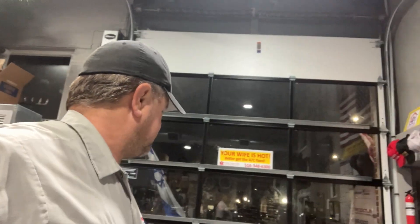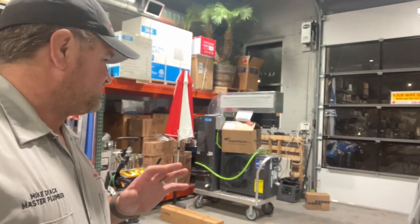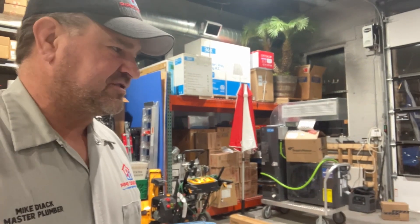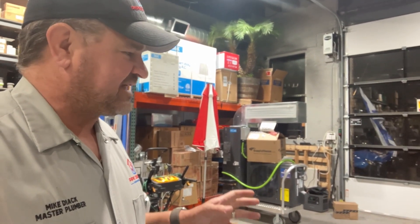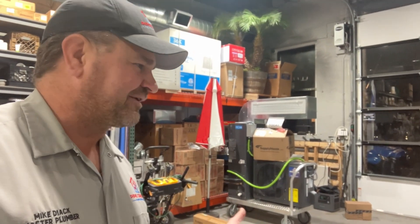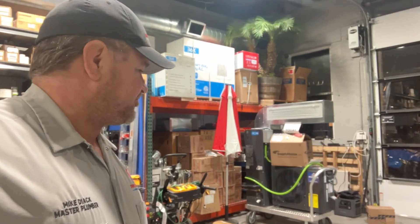It was raining outside — well, like a light mist, but now it's raining. Yesterday, Wednesday, we got a lot done. We installed the Della Optima 12,000 BTU ductless system. I got plenty of install footage. Took us right around two and a quarter hours. The electrician arrived right as I was finishing up, pulling a vacuum. Got down to 120 microns and it sat at 130 for five minutes. Dumped the charge and we were out.